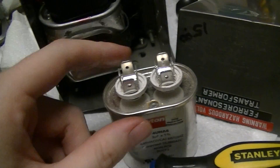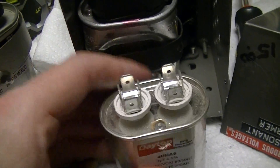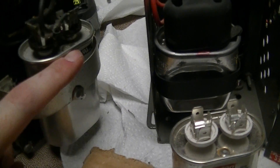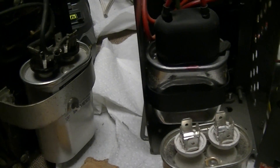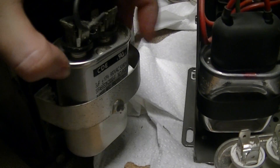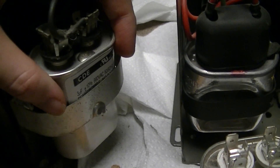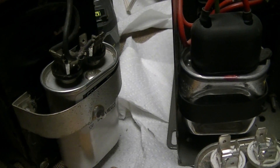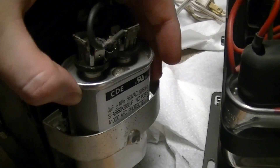Linguistic inertia. Anyway, getting back to the original topic: after the original capacitor died, I found a 3 microfarad 660-volt cap from 1974 — unused in my collection — but because I didn't reform it, and this was many years ago, that one died after a couple of months.